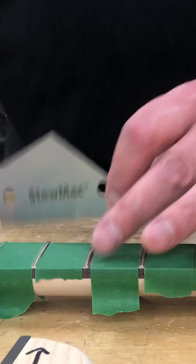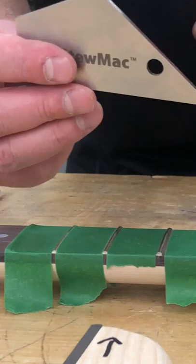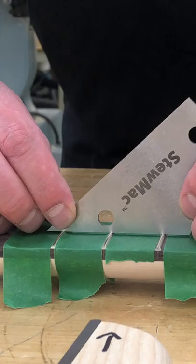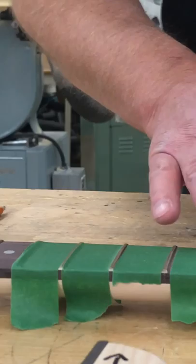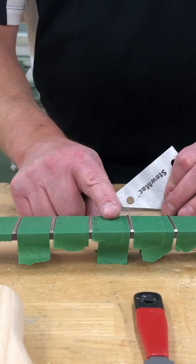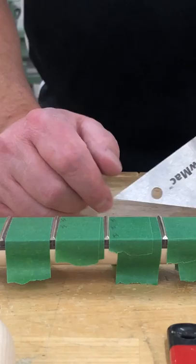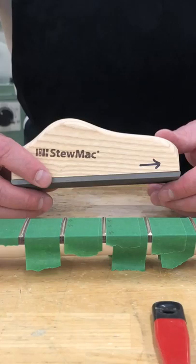Now I'll span these and see what my results are. I've got a little bit of rocking in the center and a little bit on the edge, so I'll put an H here and an H here. Moving to the next set — there was a little bit of rocking but not really that much, so I'm not going to worry about that. As you can see, the frets are getting closer together, so instead of using this edge I'm going to switch to this edge. That's pretty good across this section. When I go back to this section, I see H's here and a couple of H's here, so these frets are just a little higher than the rest of them.